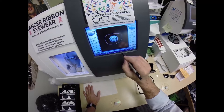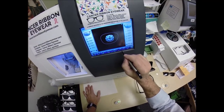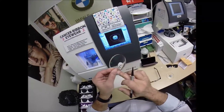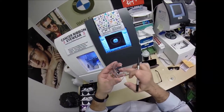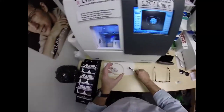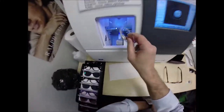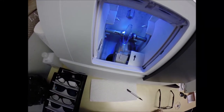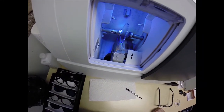I'm not going to polish the edge of the lenses because it won't be seen in this frame anyway. I'm not going to put a safety bevel on the front convex surface of the lens, but I am going to place one on the rear concave surface. Now the magnet is going to go into the chuck — or as I like to call it, the Charles — because I just don't know this machine well enough to call it chuck.